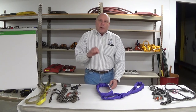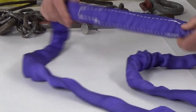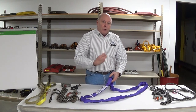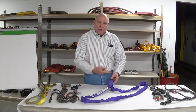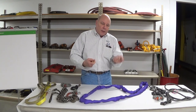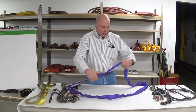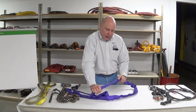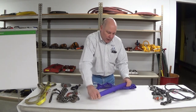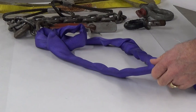We've got good marking on the sling, very much like our other sling type inspections, but we're going to take a hard look at the closing area where the sling is sewn down with the tag. I'm going to feel all the way down through — what I want to feel is a continuous bundle of fibers through the body, because it's a continuous rotation or wrap of yarns that makes up the interior dimension inside the round sling cover. I'll rotate, drag, and pull the sling through my fingers hard, trying to feel any hard plasticized area that might indicate heat damage or chemical damage. We're looking for any separation in the cover — a cut cover with exposed core yarns is a retirement and removal criteria.